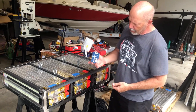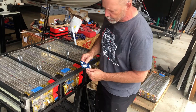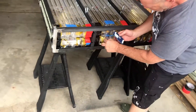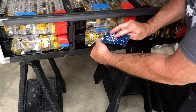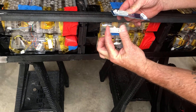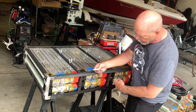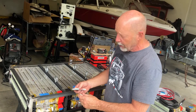These are battery management system cards that will go into and tap into the six individual cells. They slide right in here — we've got cables and everything that they plug into. We'll build a wiring harness from this; it'll come in and plug right in there. This goes directly into the battery management system, so each module will have one of these managing all of the batteries, all connected to the single battery management system.